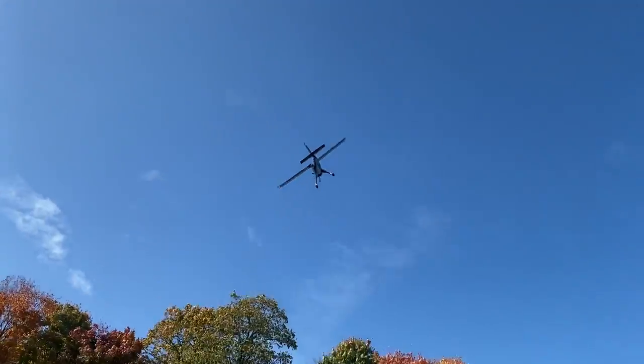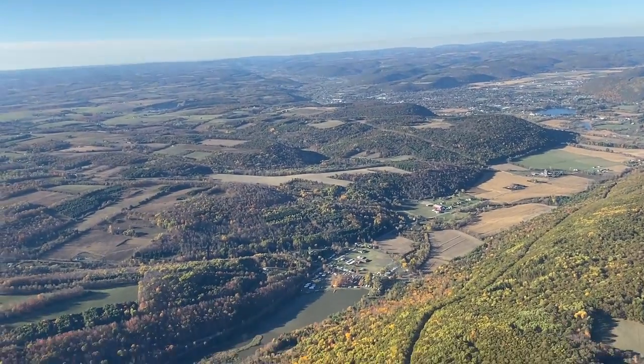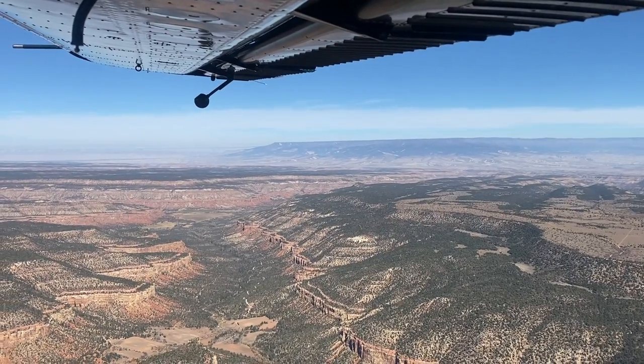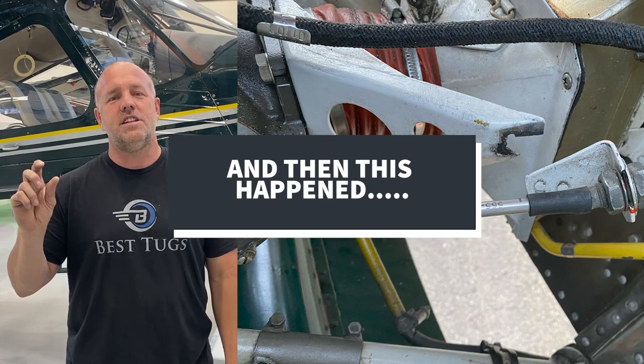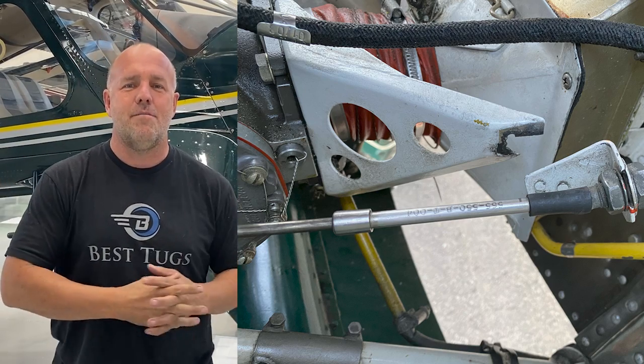There are risks when picking up a new plane — flying a plane you haven't flown. This one quit on us. The owner had been flying it regularly, so you wouldn't expect issues with a sitting engine or rust on the piston rings. Really simple: we're flying back, over mountainous terrain, good altitude, good weather. A friend of mine in the co-pilot seat was making minor adjustments to the mixture. You might expect if you're coming back real slow, you'd feel it start to get a little lower RPM, turn it back in, watch your EGTs. But a tiny adjustment — just spinning the dial, a minute change — and all of a sudden the engine went out. You think, well, that's no big deal, push the mixture back in, it's going to fire right back up. And it didn't.